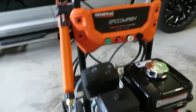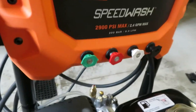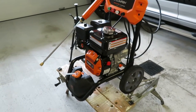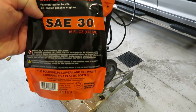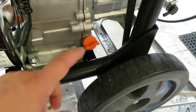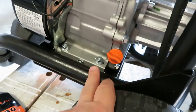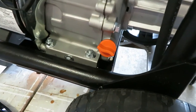I like that the plastic panel comes with rubber grommets to hold the nozzles so you always know where they are. Now the last thing is putting gas and oil in it — it comes without oil in the crankcase. They do send oil with it: a 16-fluid-ounce (473 ml) bag of oil. There are two oil fill/check points on each side of the engine. I found one side easier to access, and it took pretty much the whole bag of oil. Make sure the unit is on a flat surface when adding oil.